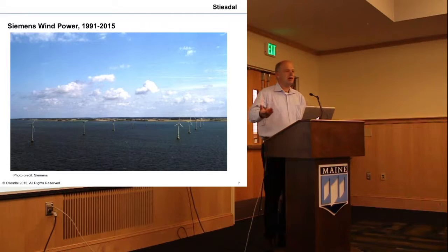We needed dehumidifiers on the inside so that it could always be below 60% relative humidity, because 60% is the threshold for corrosion of steel. So if we took a piece of steel that would immediately corrode in a marine environment and left it here on the table, as long as we had less than 60% humidity, it stays nice and shiny. We also made a building crane and a transportable crane for main component replacement. In those days, turbines were always open, so having it completely enclosed was new to us.